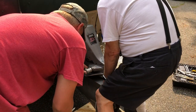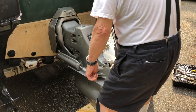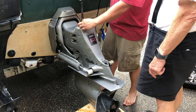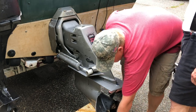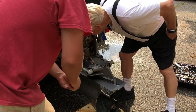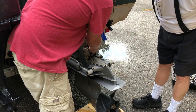That little bar can slide on out — very nice. This one hanging on there — there's a bar. Gear shift. This linkage right here — oh, that's almost falling off. It's rust that's holding that on, really. The clip came off. It's rust holding that washer. Look at that — there was no clip, it was just a washer. That could have slipped out of gear and stuck.